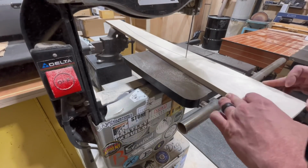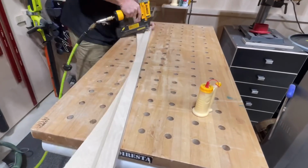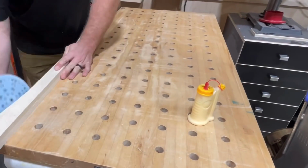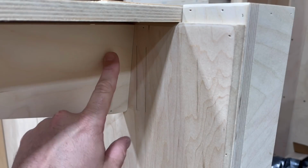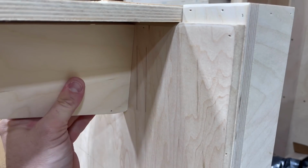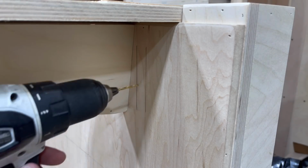And right on the bandsaw, pretty easy. The arch is there because, well, it gives some extra strength. Of course, I'm going to double it up with another piece of wood, and that's going to be facing the back. So before I completely install this, it's just compressioned in there right now. I've made some reference marks on this side and the other side that are exactly the same.